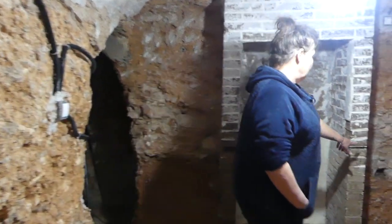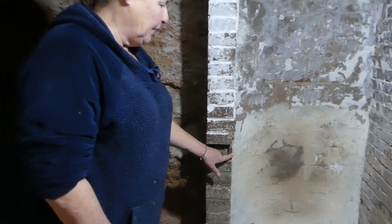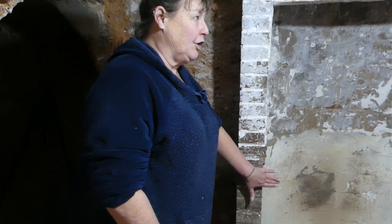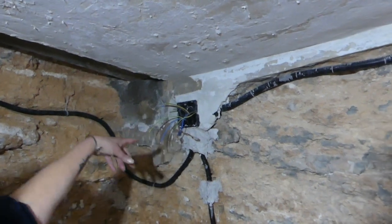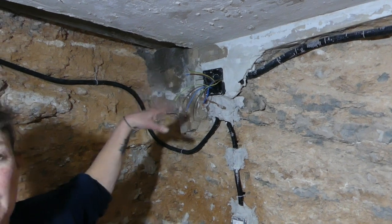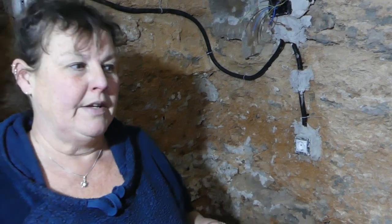We're just going to review what's going on in here. We are going to be making a mix of lime today for filling holes. At the same time, we will point up where the metal bar was, take this part brick out. We saved one of the bricks from here and put that in as a whole brick, so that's good. We're not going to bother connecting this up as yet because we don't need it. It can just stay like that. It'll get bagged up for when the lime plaster happens, so that no lime ends up on the wires. Chris has isolated it. It's all perfectly safe.